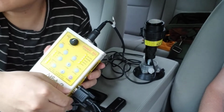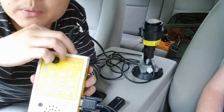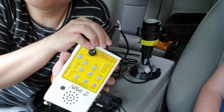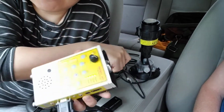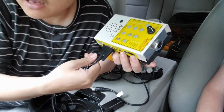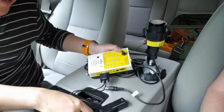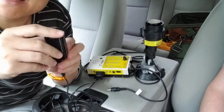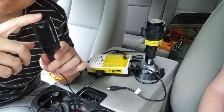Between transects, since you will have the whole thing for a few days, or probably over 2 or 3 weeks, normally we just leave this part together. All we do is disconnect here, and sometimes we disconnect that to put the detector back in the box, and then leave the GPS unit and power jack together. And the very last, this is the most important thing: this power jack doesn't work very well all the time, the connection is loose, and sometimes we just don't get power.